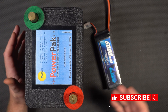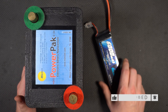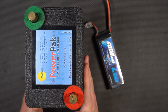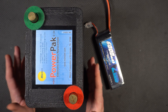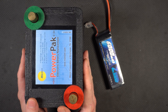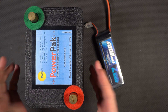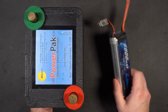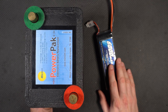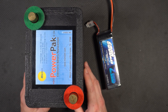After all that testing, the only conclusion I can really come to is supercapacitors aren't so super — not in comparison to lithium polymer or especially LTO cells. The only advantage they have is you can recharge them a lot faster, but at the power levels we're talking about, there's no reasonable source that can do that anyway. Then there's cycle life: this supercapacitor is rated at 500,000 charge-discharge cycles, whereas you may get a few hundred out of a LiPo. The LTO cell is rated at 30,000 to 50,000 cycles — longer than I'll be around for anyway, so cycle life isn't really a benefit.